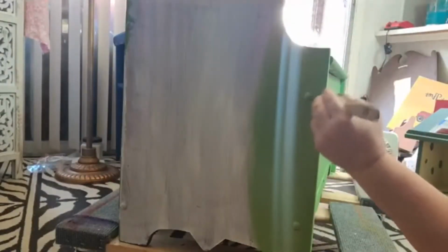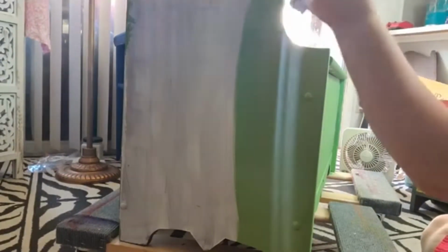And the brush going straight up and down, make sure you catch any drips around those screw holes and come back over it very lightly in a feathering style. If you leave drips, it takes so much longer just to sand those off, start all over, than it does to have patience, which is one of the things I do not have, but I've learned. If you have a little patience with that part, you'll save yourself hours of work.